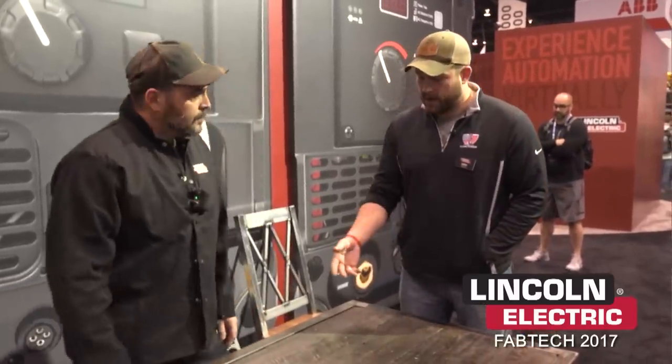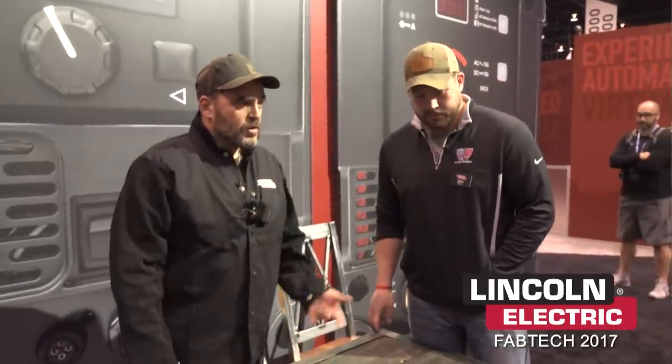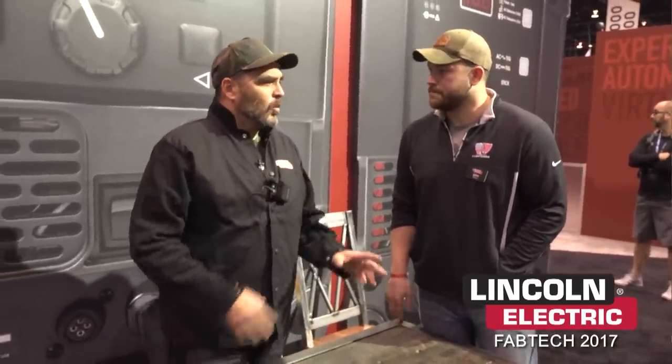Yeah, that's what I use on all my stuff that's rough sawn, because you can get a nice buildup with the water base, and it doesn't yellow, and it's also really easy to use. Yeah, that's true. The waterborne doesn't yellow. And if you're getting a lot of wood, let's say gray, old weathered wood, the waterborne keeps that natural look. Yep. Whereas regular oil-based poly will yellow it. Takes it all out. Yep, looks brown again.